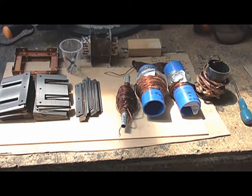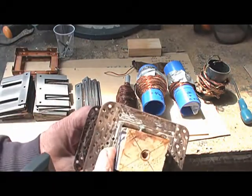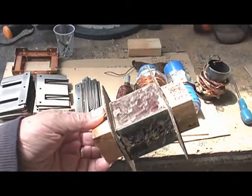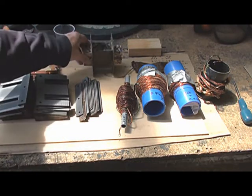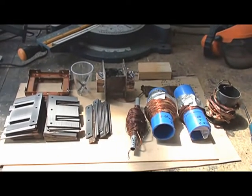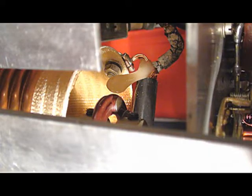So we took the wire off and cleaned up the bobbin. We had to do a bit of repair where it had burnt through or overheated. The primary winding had shorted turns. Looking at the type of damage — which I've seen before — it may have been caused by somebody feeding 240 volts into the unit when it was set for 110 or 115 volts. That also meant that the high voltage, instead of being 800 volts, would have been a lot more. It would have probably been limited due to saturation, but the RF amplifier tubes would have had a lot more volts on them. The RF output would have been a lot higher — it might explain why the coax in the pi coupler, from the anodes of the valves through to the output into the antenna, was actually melted and shorted out.